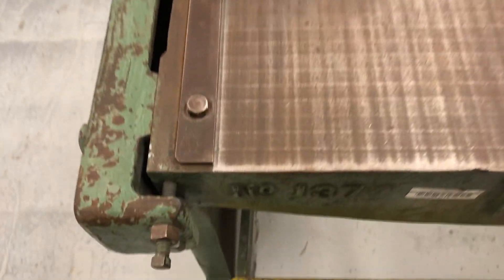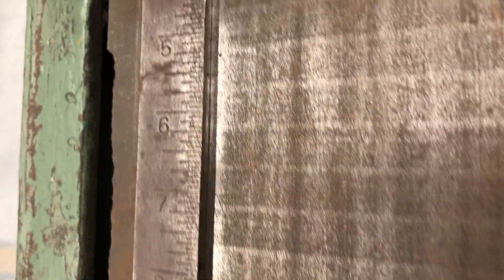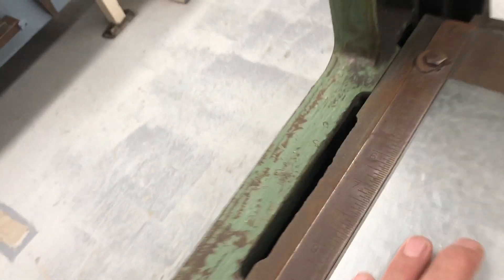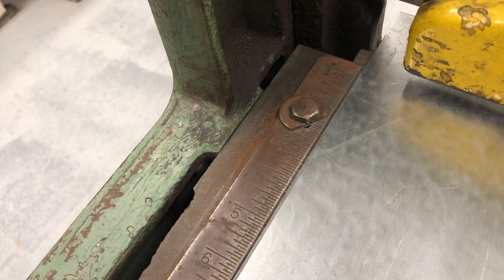There are rulers and scales right on the side of the machine. This is called the side gauge, and it has a ruler right on top of it. You would slide the metal up against the edge of that — hands pushing down and then sliding over against the edge of the ruler — then slide it up until the bottom of the metal is at the dimension you want. I want to cut it at four and three-quarter.